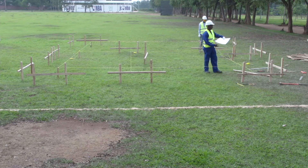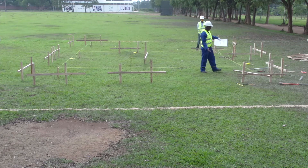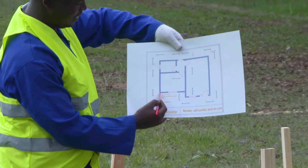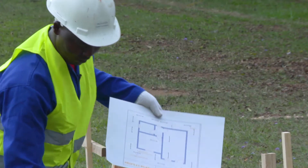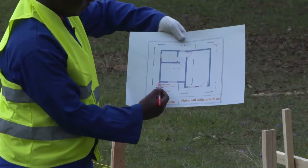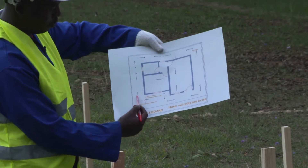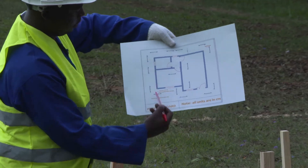Here we come up to figure it out. So we are going to fix our profile board, as you see. You check your drawings. This peg is located in the middle of this wall. This yellow color that you see is the building line. Now we are going to extend this center to the profile board. We need to pull this building line up to the profile on both sides — on this y-axis and this x-axis.